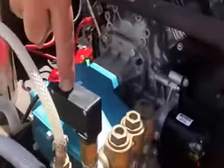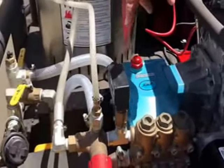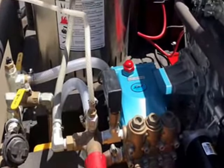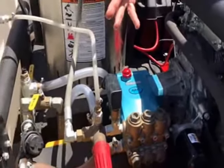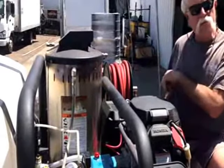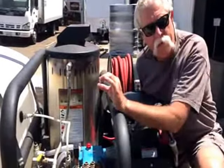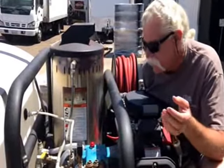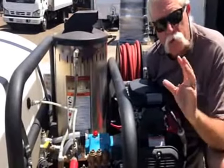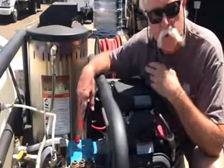It's a dumb mistake because the switch isn't even rated for that on the contacts — we need more than a 20-amp rated set of contacts for any reliability with our 12-volt burner. Not only does it kill the switch, but it also kills the igniter — so that's $190 to $250 out the door plus labor and downtime every 12 months like clockwork. This needs a relay on the heater circuit with 70- or 80-amp contacts. It's not rocket science; it's just making things more bulletproof. This ought to have a flow switch instead of a pressure switch, and that flow switch should be controlling a relay.